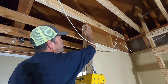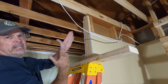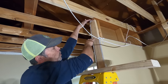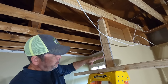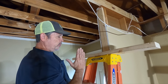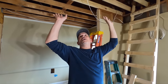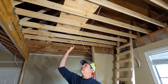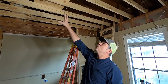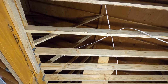Then I got the wall plumb and fastened the wall to the joist. But I noticed that the wall was kind of hinging — and that's exactly what it was doing right here. They basically built this little one-foot wall on top of the eight-foot wall. So I put a continuous two-by-four on the end to secure it all together, and it's much better. And in addition to that rafter, we put up all the rest, so they're permanently secured over here and nailed over there. And if you look past the joists up into the attic space, you'll see the braces we use to transfer the roof load to our new beam.